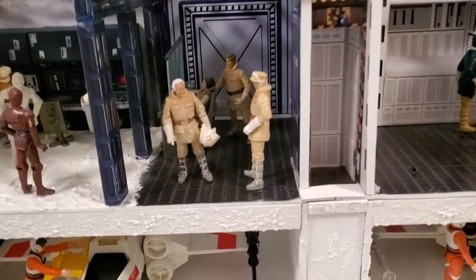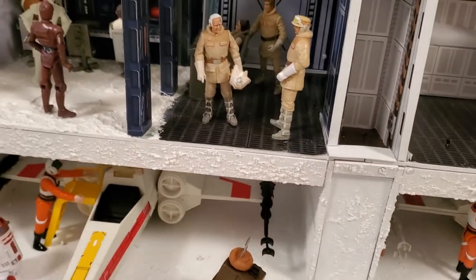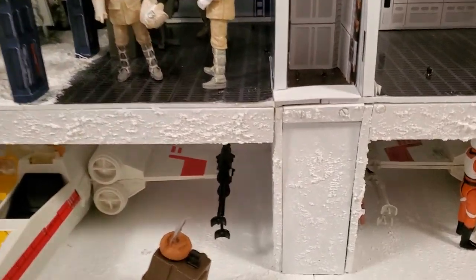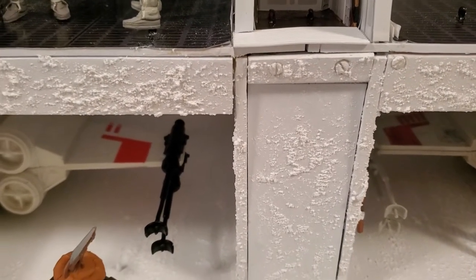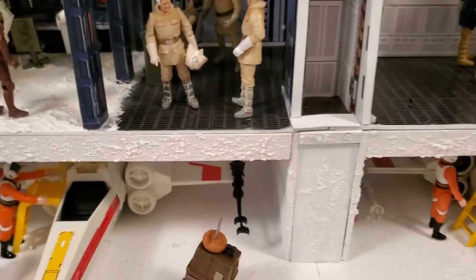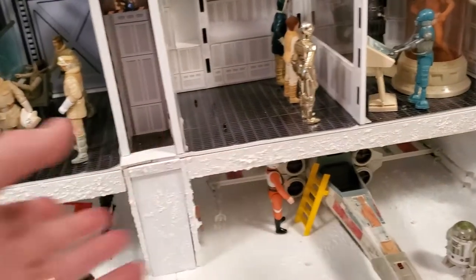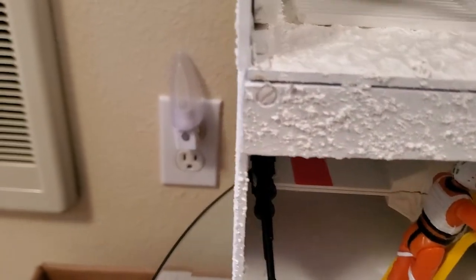It's constructed of 1/8-inch plastic — I bought a bunch of styrene plastic 12 by 24 sheets, cut them to fit, and then everything is held together with 4-40 screws and nuts made out of nylon, so it's very, very sturdy. I'll demonstrate that towards the end of the video — a guy can lift this with both hands just off from the second floor and you can totally move it from place to place. You can see a nylon screw there holding on this front fascia, and there are nylon screws holding the sides together.